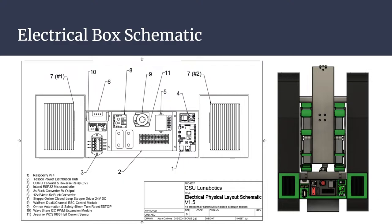On top of the power distribution board, and we'll probably have to make 3D printed mounts for this, we'll have mounts for this. This is the DC motor controller for the two digging motors. It's two channels, so it can run two DC motors at once, and you can control the percent of rotational speed with PWM signal, so we can use the signal straight from the Pi to control those motors.